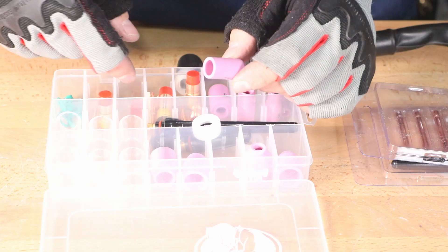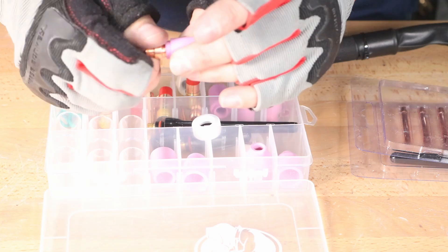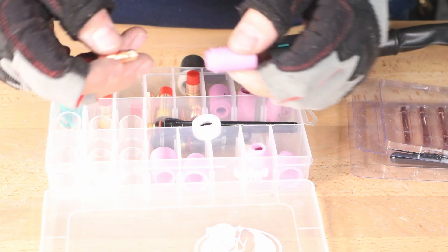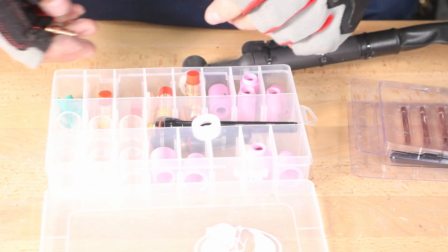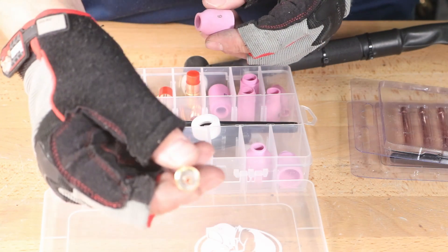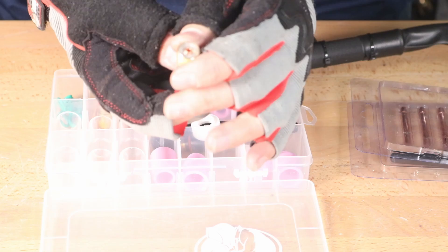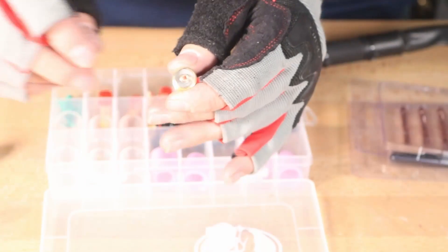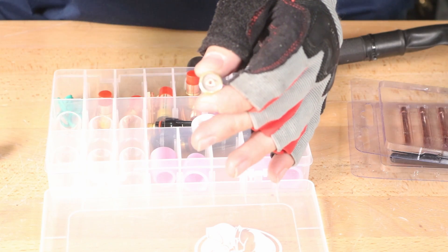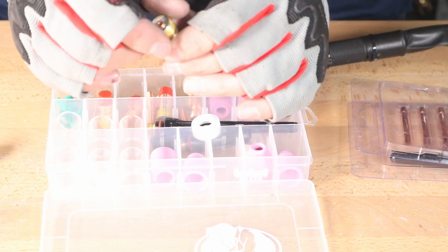Now it has both what's called a standard collet body — that uses a cup where the gas will just come and flow out, and that's a pretty standard setup. But it also has a better setup for a lot of things — not better for everything, but most of the time it is — using a collet body called a gas lens. They use these little bit larger cups, and what a gas lens is, it has this little mesh screen here that acts as a diffuser to help the gas come out smoother. That can be really helpful, especially if you're welding things like stainless steel. So I'm going to go ahead and assemble it with this stubby gas lens.